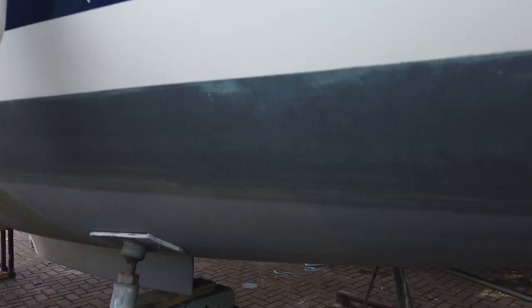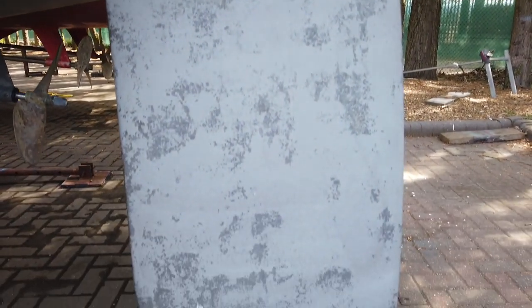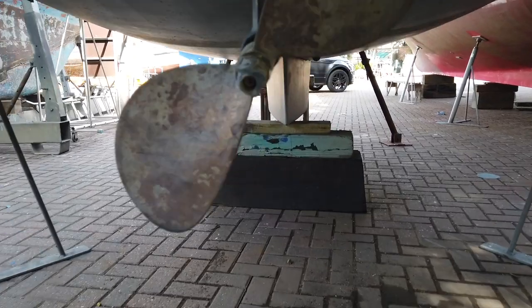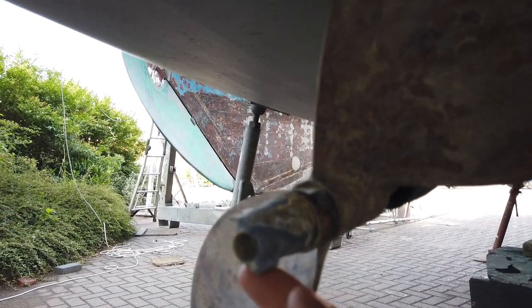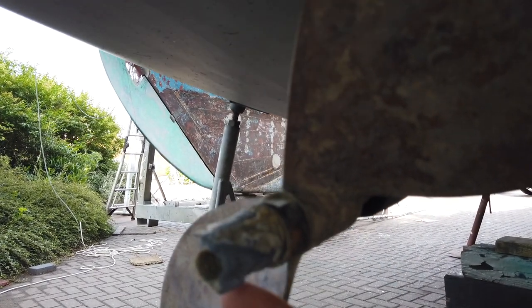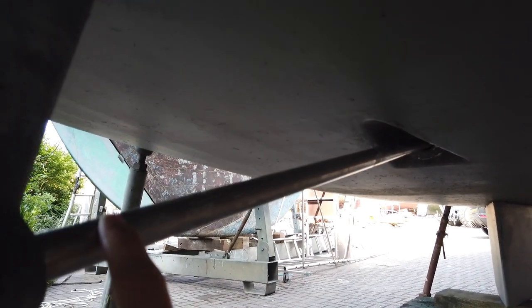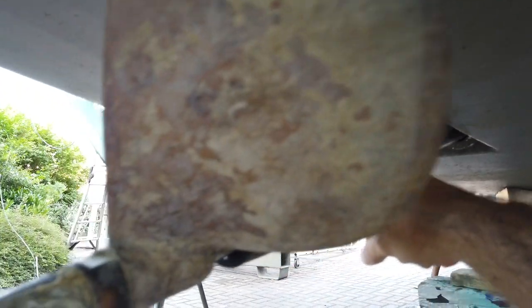It means I can check on a few other things. The antifouling was only done three months ago, so you wouldn't expect much erosion - and that seems to be holding up okay. The main thing I wanted to check was the anodes on the prop. When I got down here, she only had one anode, which I had replaced. It was a brand new anode that went in the water three and a bit months ago, and as you can see, it's pretty much destroyed. She was on Lake Windermere in freshwater before, so she didn't have an anode on the shaft.